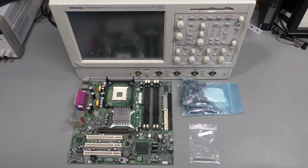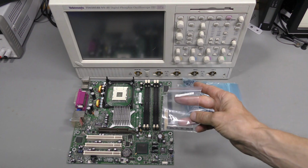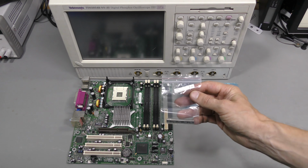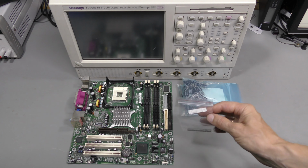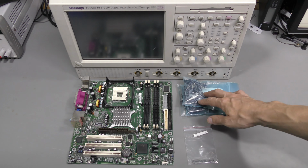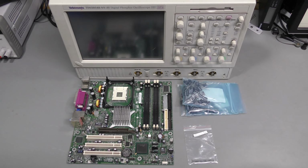Of course, I might be wrong, something else might affect this and somehow cause this chip not to start or something like that. But my current hypothesis is that this chip is dead, so I bought a few replacements. They were sold as a lot of 5 pieces, about $8 delivered from China. These are ADP3168 chips. And I also bought a bunch of electrolytic capacitors from DigiKey to replace on this board and on the board which is currently in the scope. Let's go!